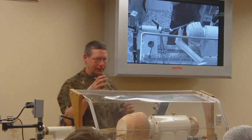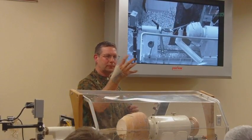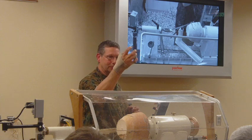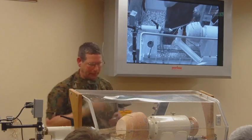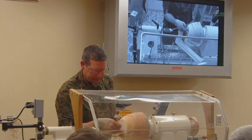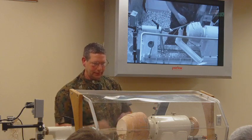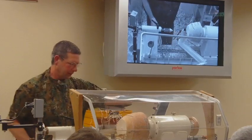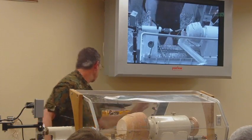If you have wet wood, we'll crimp the fibers and then crimp it a little bit more, because as it's drying, it crimps out. So I'm going to try to be a little bit more careful. I want to get this right here to fit the chuck. Remember, that's the part. So we're going to take it down.